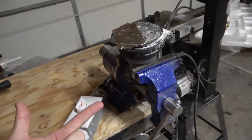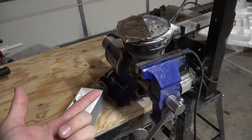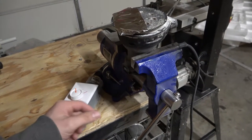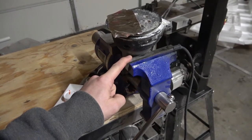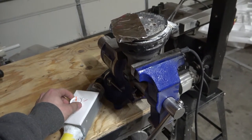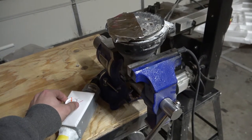Now for any sort of brushed tool this works fine, but when you get to a brushless AC motor it no longer works. Here I'll demonstrate it with a random orbital sander — it does have a brush motor on it — so when I turn it on, we'll be able to control the speed with this knob right here, just like we would a regular light.